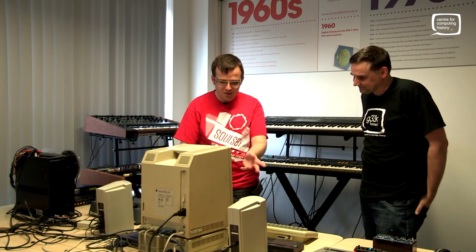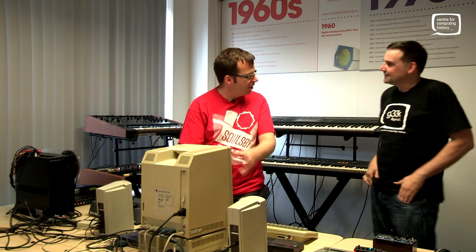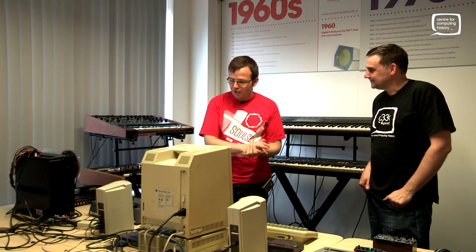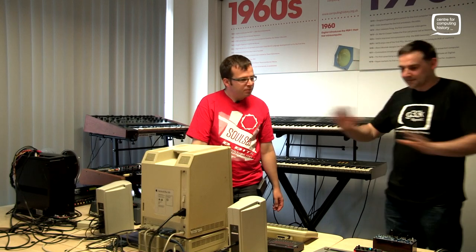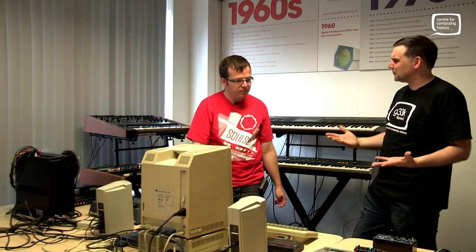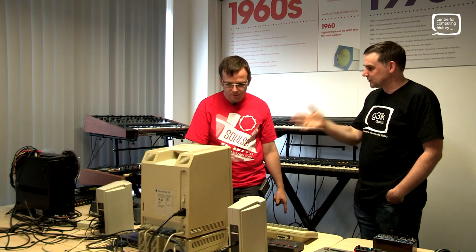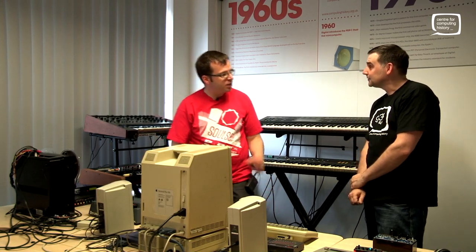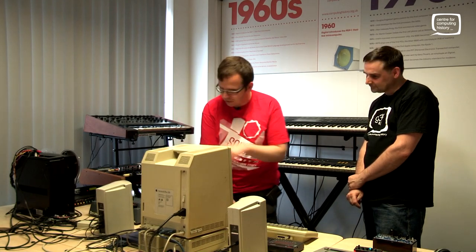The kids that were recording a track earlier were slightly surprised — I was trying to explain that they wanted to do the vocals and they were like, well don't we just do that onto the computer like we've done everything else? This could not record any vocals — you could have like half a second at most. So we got the tape working, and the kick went onto one channel, the rest of the drums onto another, and then the synths in stereo on three and four. It's so far removed from what we have now. It's really nice to see a setup that shows people how things work and how difficult things were. If you were messing around with the sync track and there was any degradation, it would just lose sync and you'd be completely messed up — that's actually why I had to clean the heads, because the sync was starting to drop out.